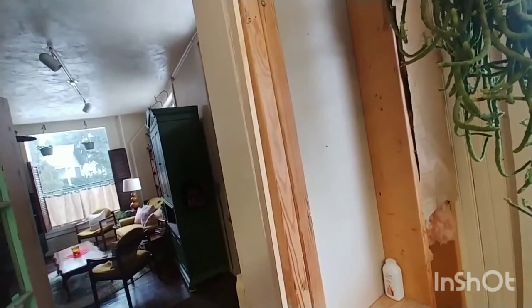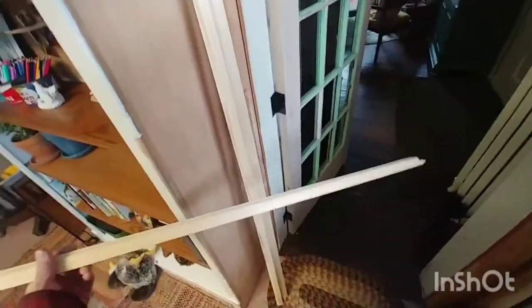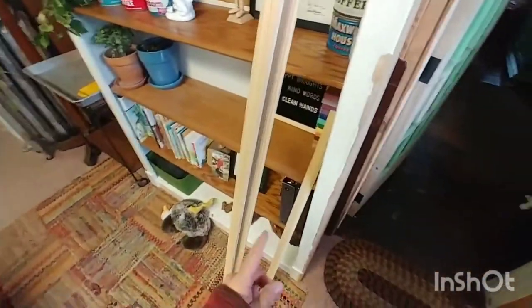I know that a conventional door's rough opening is almost always 82 inches, which is 2 inches shy of 7 feet. So an 8-footer will always do one side of a jamb. And 8 feet out of 12 will always ostensibly do the other side of said jamb, leaving me 4, and 4 will almost always be wider than any ordinary man door you're going to put in. So the most economical way to buy stop for one door opening, in my opinion, I thought a lot about this: 1 12-footer and 1 8.